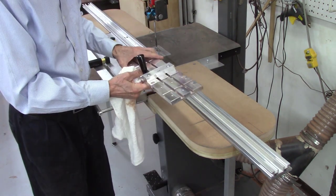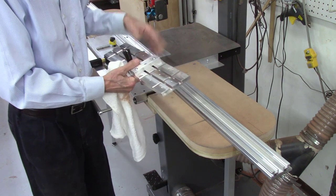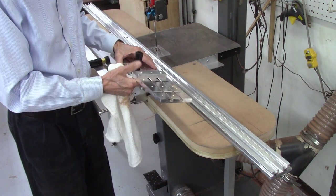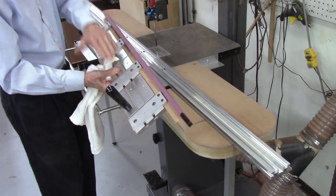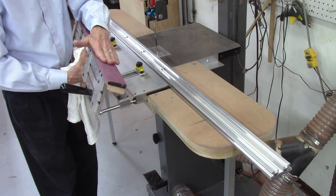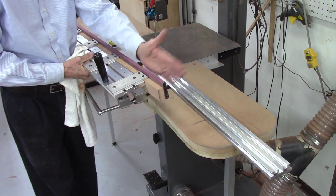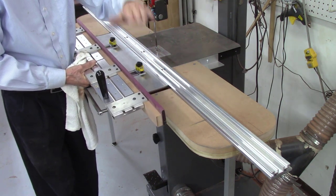I've tended to go to these new AccuSled 2 carriages. We have an 18-inch model and a 30-inch model. I prefer these over our other carriages just because they're more versatile — I can use flat plate clamps, 3-inch, 4-inch, or 6-inch L-brackets depending on the type of wood I'm cutting. This is the 30-inch model using flat plate clamps to clamp a shallow board. It is important that when you're cutting a board, your board be totally supported the entire length with a sacrificial fence. If you don't support the end of the board on the front edge, when you start getting a cut you'll get vibration, and that vibration will give you an inaccurate cut. Always make sure your board is supported by a sacrificial fence, and especially on taller boards support the entire height.